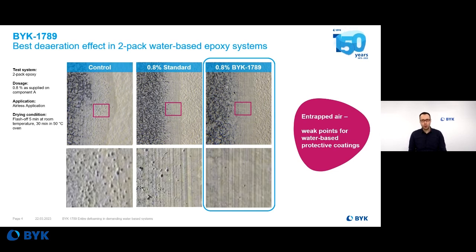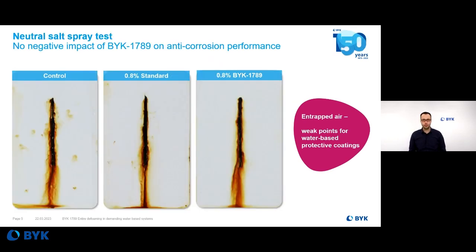Especially when it comes to protective coatings, the foam inside of the paint matrix is really problematic, because this entrapped air will lead to weak points, which is bad for corrosion protection. Where a foam bubble is inside of the coating material, this foam bubble can be filled with corrosive media like water or salt, and it performs very weakly in corrosion testing. Here, the same formulation as seen before after a few hours in the neutral salt spray test — the same coating, just with another kind of defoamer, leading to a different degree of rusting in corrosion resistance testing.